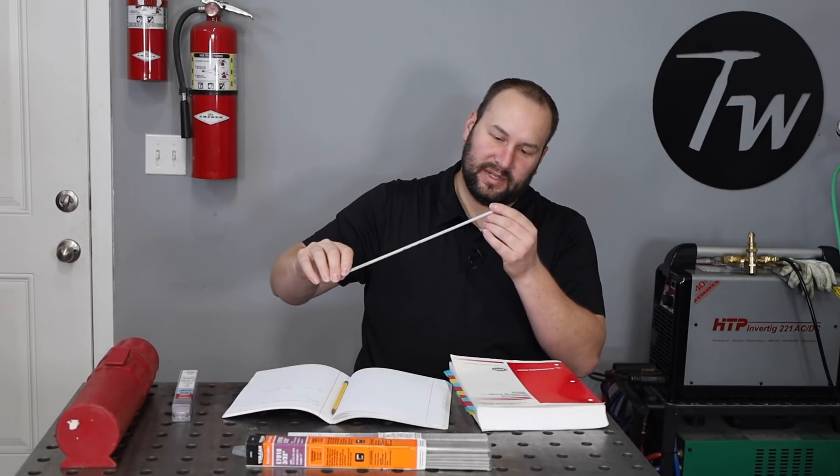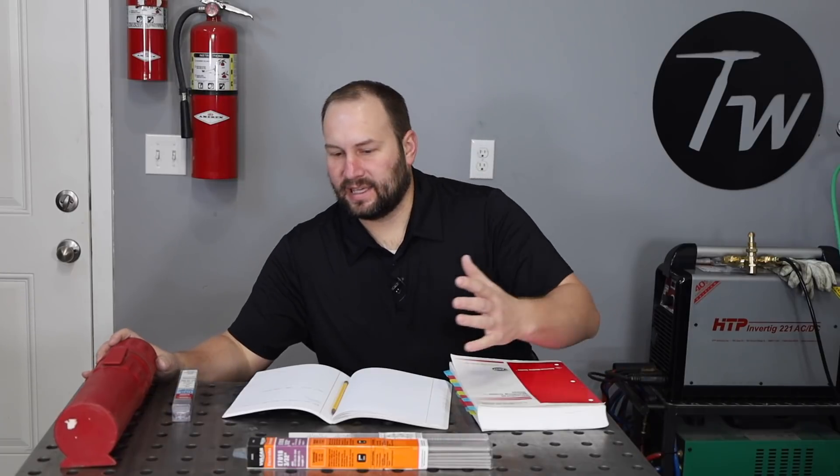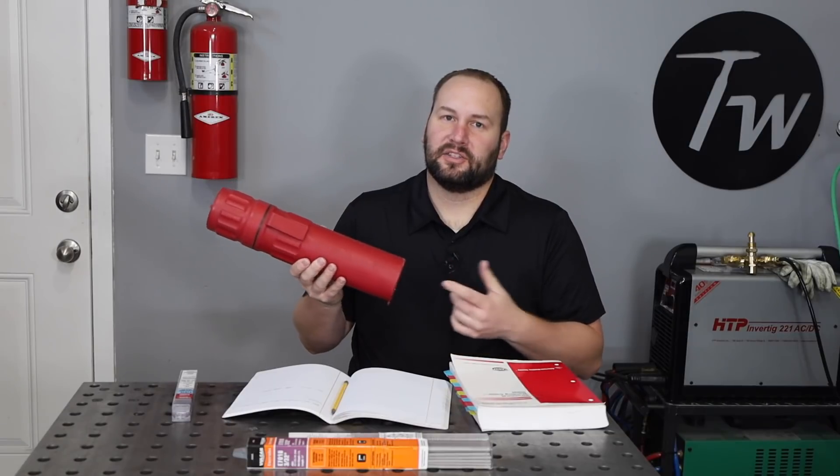For regular Joe in the garage, does it really matter? I often hear people say they don't use 7018s because they don't have a rod oven, so they use a 6011 instead. Well, that doesn't really solve the hydrogen problem — you're dumping tons of hydrogen in if you're welding with a 6010 or 6011. I like to run 7018s not just for the low hydrogen reason, but because they run really nice: you get a really smooth bead, the slag comes off easily, and there's a lot of great things about running a 7018. For me in my garage, I'm typically welding on stuff that isn't in any critical application — usually about a quarter of an inch or six millimeters thick or thinner, and just regular mild steel. So I don't have any of those other ingredients involved that would lead to hydrogen-induced cracking. For that reason, I feel comfortable keeping my electrodes in one of these storage tubes rather than in an oven. I'll put a link to these down in the description.